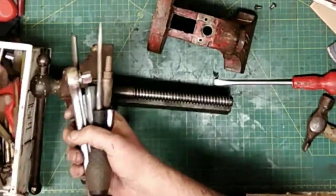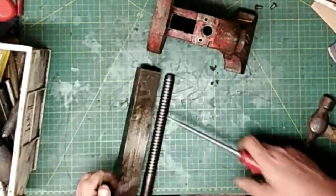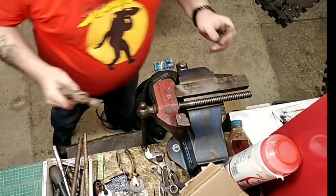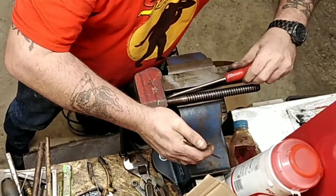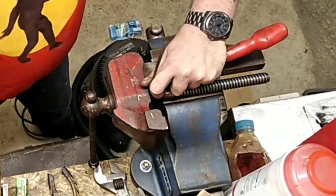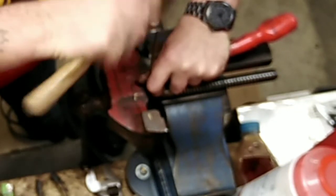There's quite a lot of fighting against the spring - the spring is very strong. In the end I decided to stick it in the vice to hold it still. Once it's securely held by the vice, it's just a simple case of pushing the washer with a screwdriver, holding that in one hand, and in the same hand hold a tap and hit it with a hammer - gently tap that all the way through.